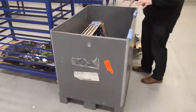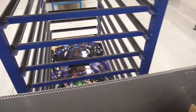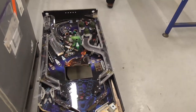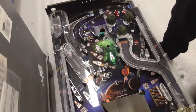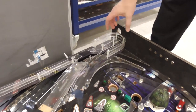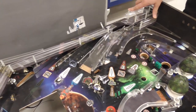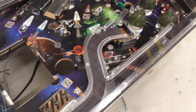And then we have more Alien playfields here ready to go onto the line. And if you're careful not to trip over one of the earlier Alien prototype playfields here — what were the differences in this prototype playfield to a production one? You'll notice the ramps are completely different. These platforms were very difficult to fit initially because there's a lot of plastic in them and because of the way we build these up with the different layers and the different artwork layers — it's quite a complicated piece to build up. This was a nightmare to fit on the early prototype games, but the latest version is much easier. You'll also notice the exit of the Reverso is plastic here, whereas on production games it's a wire form.